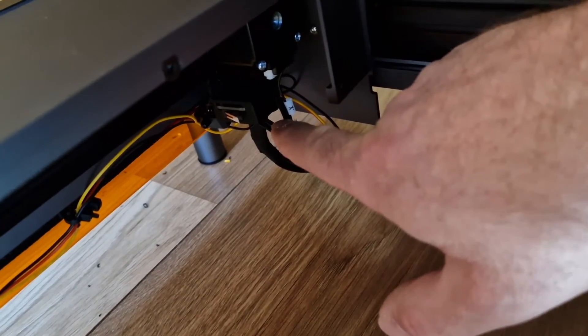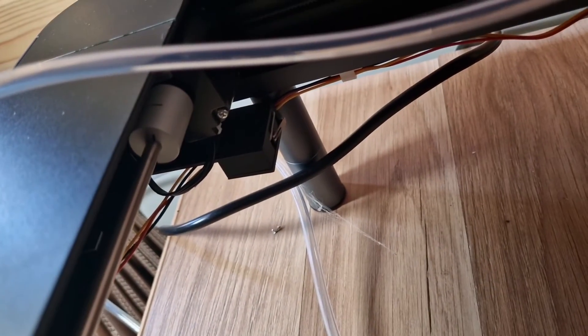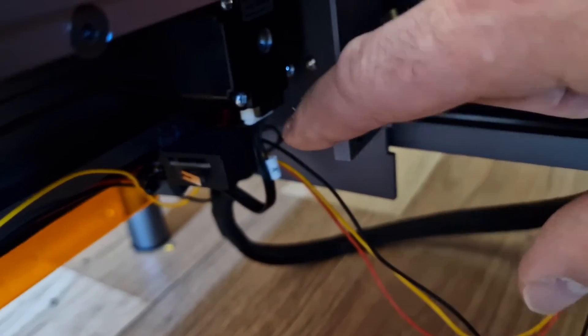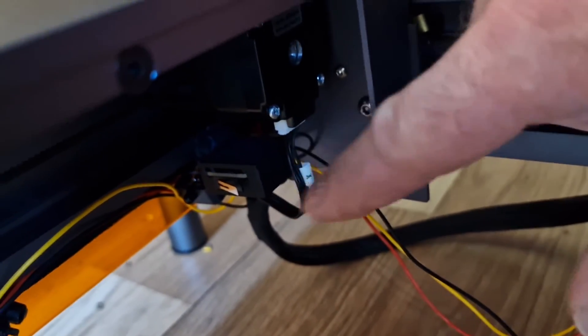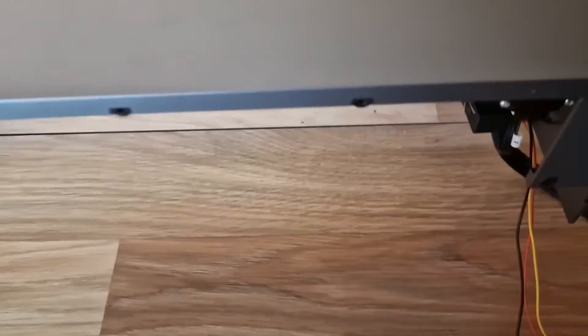That's something to be careful with when putting that wire into the switch — take a bit more time and don't pull it in. My other suggestion: for all the limit switches, especially the one on the carriage itself, connect up the cable first before putting the switch on, because I think that was half my issue. I connected the switch and then pushed the wiring, there was a little bit of tension, it got caught and pulled the wire out.